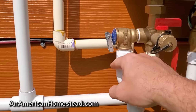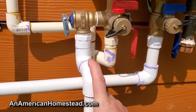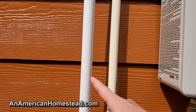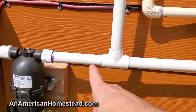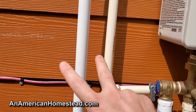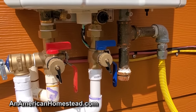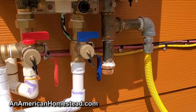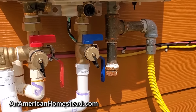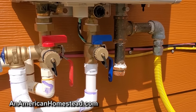When the system gets too much pressure and it blows — it's a pressure relief valve — basically if too much pressure accumulates in the system, this can blow out that way. So it's not really a line that's active; it's only active if something bad happens. I have the cold water in here, the hot water out here going up into the house, and the cold also goes up into the house. It comes out of the accumulator tank, goes up into the house for the cold, then over to the water heater and out for the hot. I consulted a gas expert before hooking it all up and he told me what I needed. Everything seems to run fine — it's probably not to code the way it would be in a municipality with ordinances and regulations, but it works for us.